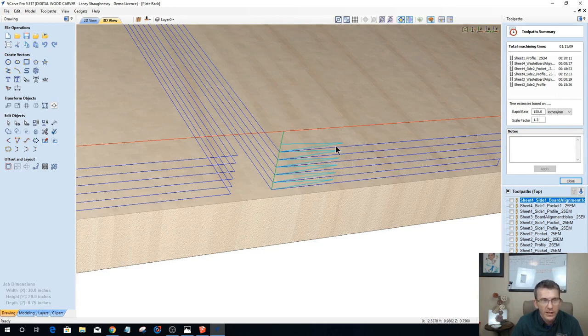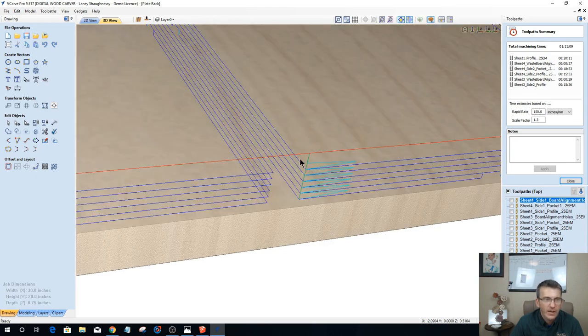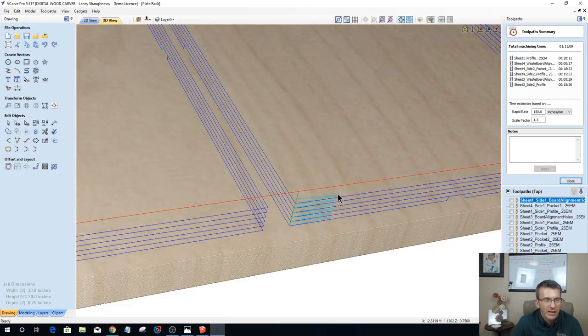And it's zigzag, and it's less wear and tear on the tip of the bit, a little less work. It's working one side of the material with that zigzag motion. We don't have a straight plunge bearing in, dulling the tip of our bit over time, and we don't get witness marks. So that is a zigzag motion. You have zigzag, you have smooth. You've got lead ins and lead outs, which we've talked about before, but the zigzag ramp helps extend the life of my bit. It's not plunging in, dulling that tip quickly and burning it up, depending on how fast I'm plunging. It's taking a little less cut as it gets down to that 1/8 inch pass depth. Then it goes around, down and around, down and around, when it gets to each of those passes. That's a zigzag.